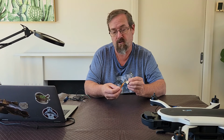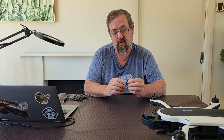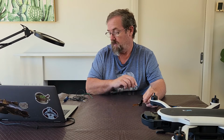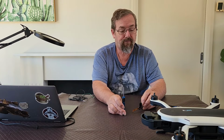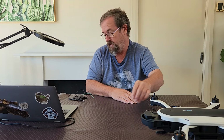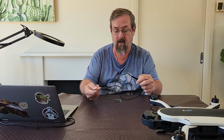The other option is, we did a video on how to make basically one of these boards. It costs, I think, around $15 to $20. And it's probably a much safer option, because you can make that board, disconnect the cable from the original one and plug it in, and therefore you're not potentially going to cause any issues to this actual board. You'll need a hex screwdriver to undo the screws. This one's a T8, so it's a torx actually, not a hex. The other thing you need is a little bit of wire.